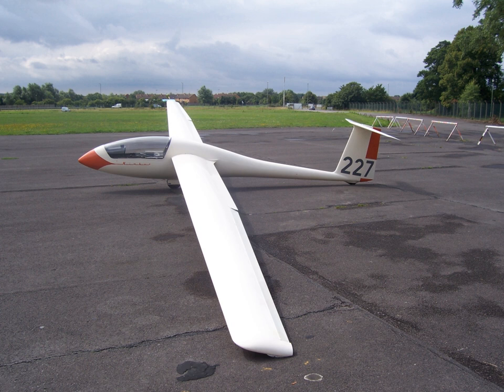Max aerotow speed, 180 kilometers per hour, 110 miles per hour, 97 knots. Max winch launch speed, 150 kilometers per hour, 93 miles per hour, 81 knots. Maximum glide ratio, 42 at 120 kilometers per hour, 75 miles per hour, 65 knots. Rate of sink, 0.7 meters per second, 140 feet per minute at 85 kilometers per hour, 53 miles per hour, 46 knots. Wing loading, 51 kilograms per square meter, 10 pounds per square foot.